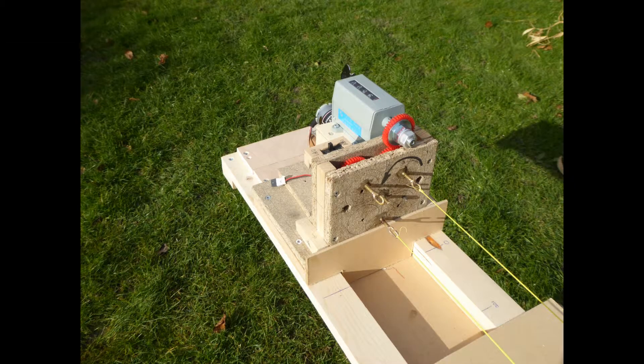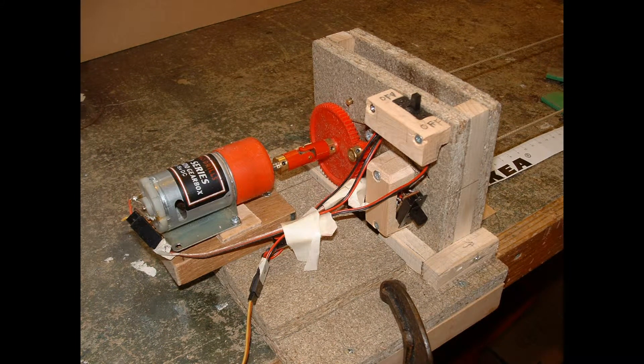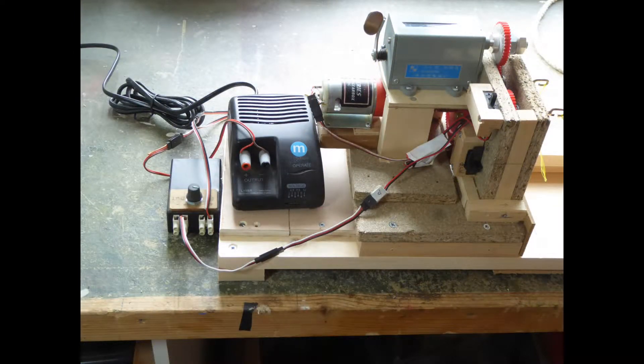Forming the rope is done in two stages. The left hand has three fixed hooks which spin to twist the threads. The right hand is a disc with three hooks which spins to form the ropes. The thread twisting engine has a 1 to 100 geared motor driving a gear train to rotate the hooks. A counter records the number of turns when the threads are twisted to reduce their length by 12.5%. The bench supply is set at 12 volts, and a voltage regulator lowers the motor to about 6 volts to get the hooks rotating at 300 rpm.